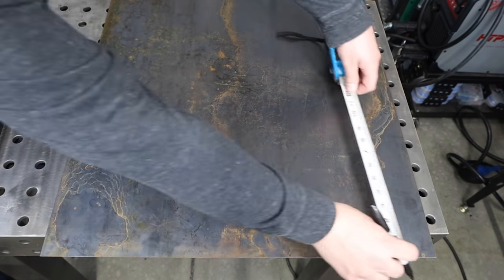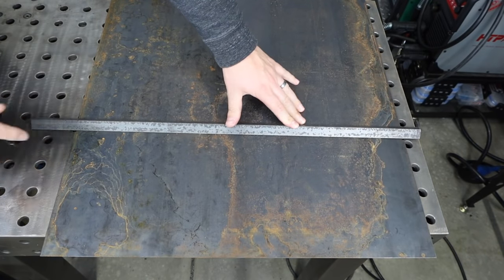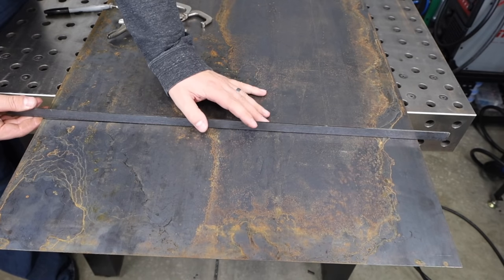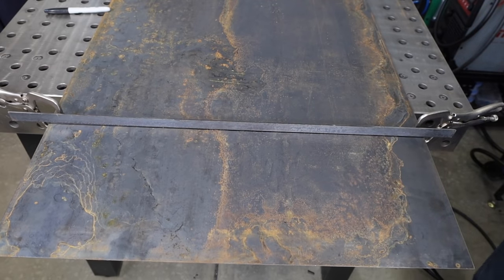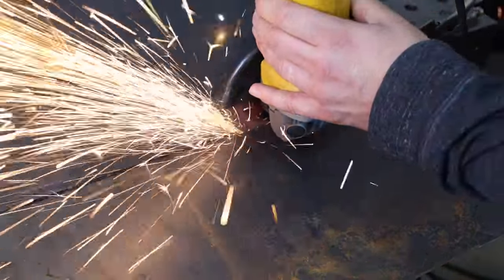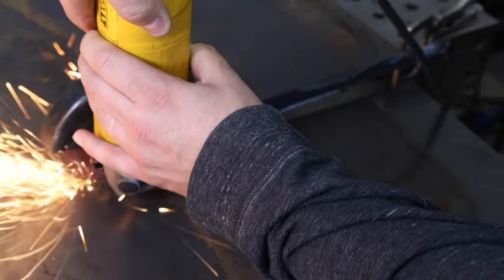The first thing you might need to do when working with sheet metal is make a nice long straight cut. In a sheet metal shop this is typically done with a shear, but here we're going to use an angle grinder. To get a nice straight cut, I'm going to take a piece of angle iron and clamp it to the material as a guide. Since cutoff wheels aren't made to grind sideways, I can just rest it along there as I cut all the way along the piece. I want a firm grip on the tool but a light touch on the material.